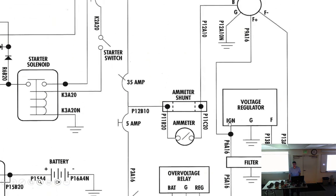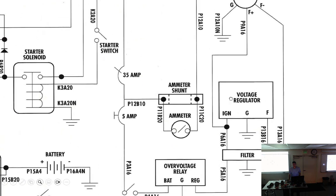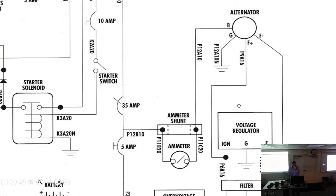And is that the same for all alternators? All alternators are not self-exciting? Or are there some examples of alternators that are? I think they're all not self. I have to be careful, because now they're starting to make some that I believe are. There are backup ones that are very tiny, and I think they run off permanent magnets. Okay, so I just didn't want to say all alternators. But that's only to start it up. Afterwards, the alternator is able to pick itself up. Once it's started, it produces enough voltage that it feeds itself. But generally, they're not self. You have to have that field.